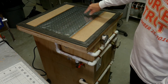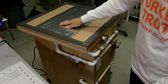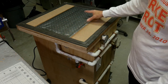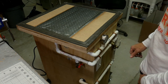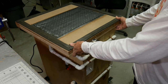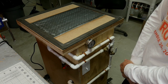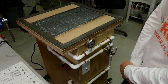Right now I just have masking tape over these holes to simulate the plastic, which should just block them off. I did seal around the edge of the metal, so theoretically the chamber should be sealed up and the leak has to be somewhere between this valve and up to this point. Through process of elimination I'll slowly work out where I need to go with this — it'll just take a little bit of time and tuning. Then we'll have a really good table to do a lot of interesting vacuum pulls. Still a lot of fun stuff and interesting projects coming up. Until then, we'll see you on the rocks.